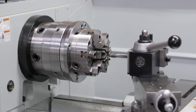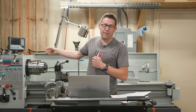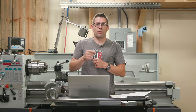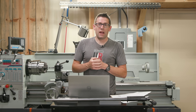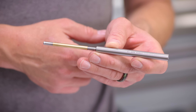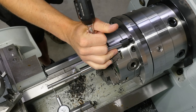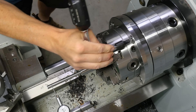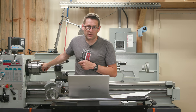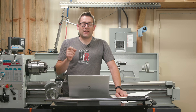We've got the Truebore Alignment System — this is an articulating chuck that does axial and radial alignment, clamping your barrel with a six-jaw chuck, which gives you a lot of great versatility and more even support for those delicate areas. I've got the SSG Range Rod, which is optimized for use with the Truebore Alignment System — a really great pairing. It uses two bushings, one further inside the barrel and one out towards the end, to align a rod you use with an indicator to dial the barrel into absolute perfection.